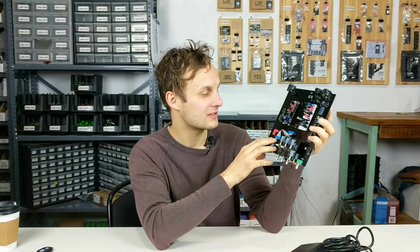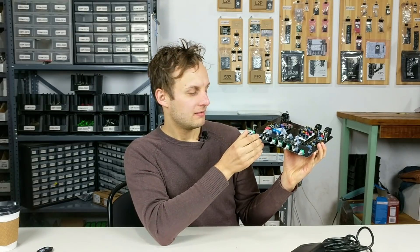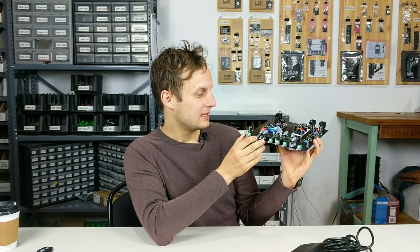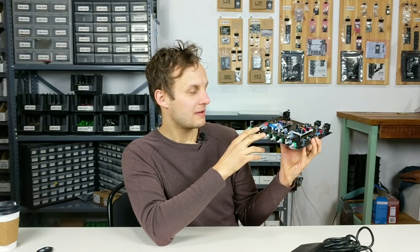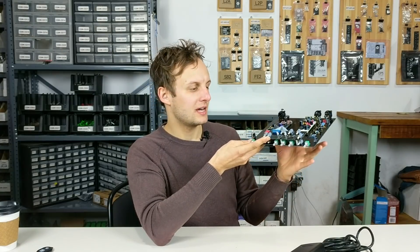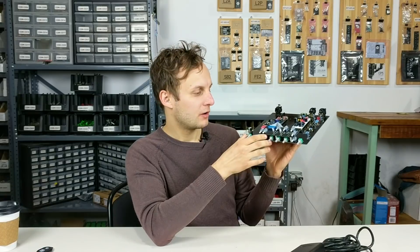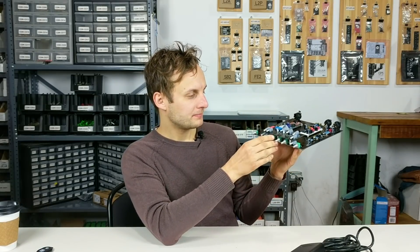Overwhelmingly your feedback was: we want two channels with all the bells and whistles. So I'm very happy to have worked on that because it's a lot of fun to add features. So what features do we have? We have the mic preamp gain — all important — the standard housekeeping features of a mic preamp: plus 48 phantom power, the pad (20dB pad), polarity switch. Then we have a couple of unique ones. A line input — so not only is this a mic preamp, it's a line level processor you could use during mixing. And this isn't just a pad either. This is a totally separate input with a different line level receiver, so it's really optimized for both line level and mic level. It's a true line level input.